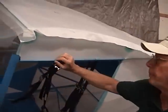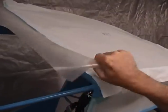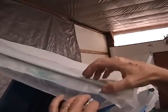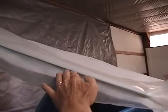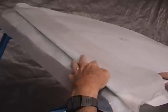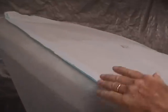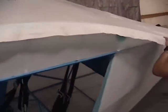We're going to go ahead and set it back up in an upright position now, pull it lengthwise in the fuselage and start working the wrinkles out, then light tack it into the glue we put on earlier. Here we've got the fuselage back up in pretty much an upright position. If you look along the top, you can see how the fit is where we've inserted the fabric into there. The yardstick is actually back past the overhang — we've got that pushed in pretty well, bedded out to the bottom of this cavity. So that fabric is making a nice S-curve through there, glued on all those surfaces. That'll add an awful lot toward future corrosion protection.